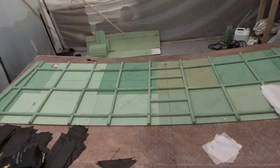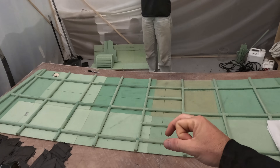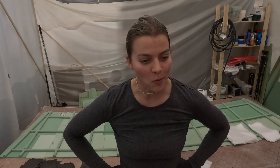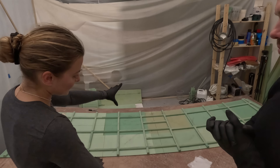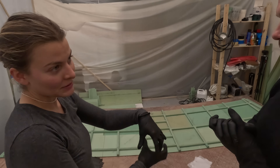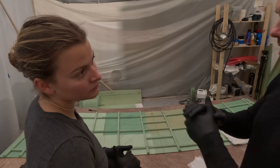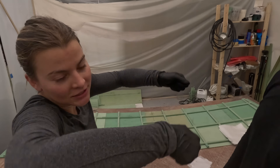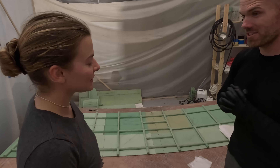It is time to lay up this piece. This is the part that will go from what we've already built to the standing rigging, which will be right here. This is going to be our first time using the form that has now been glassed, epoxied, and sanded by Brett as our bottom half of our vacuum bag suction situation. We'll put one piece of plastic on top of the piece taped to our actual form, so when the air sucks out it forces the piece down on the curve - to the form - rather than just sitting on top of it. So for the first time, we won't have to put a bunch of jugs of water or weight to hold it into shape. The actual vacuuming process will hold it into its shape.